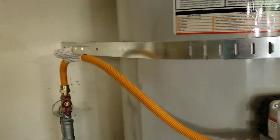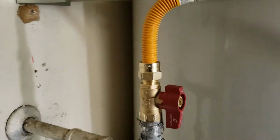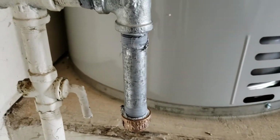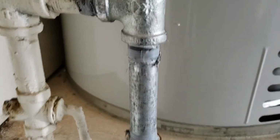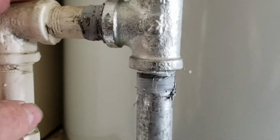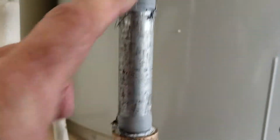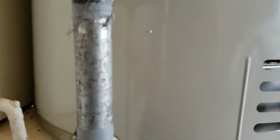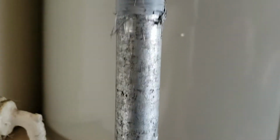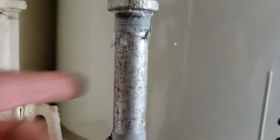And then starting at the bottom, we've got a brand new gas shutoff valve. We did go ahead and get you a drip leg on here. Some localities enforce this, some don't. What this little piece is for, in the event there's any kind of debris in the gas line, which PG&E says their gas is clean, but if there is, it fills up this little drip leg, and then, I don't know, every 5 years, 10 years, 30 years, you'd pull this out and get rid of the debris. Anyway, they may or may not want that. If they do, it's installed.